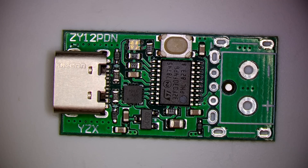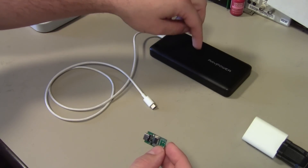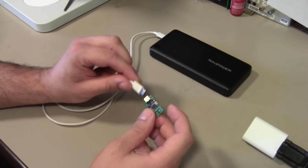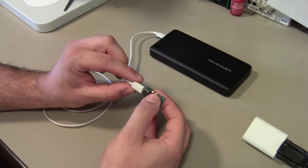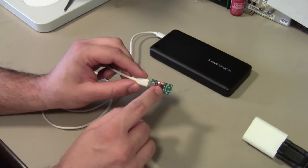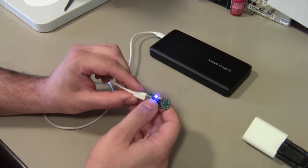So let's plug this into a USB-C battery pack and see what that looks like. For this demo, we've got a USB-C power delivery battery pack that supports all of the voltages — 5, 9, 12, 15, and 20. A standard C to C USB cable, and then one of these power delivery trigger boards. Right out of the box when you plug it in, you'll see the LED illuminate red and you'll see five volts on the terminal. As you click the button, you can see it toggle through the different colors — this microcontroller is having a conversation with your USB-C power source and negotiating the next power level. When you first plug it in it's red and you'll see 5 volts. Click it, you'll see yellow — that's 9 volts. Click it again, you'll see green — that's 12 volts. Teal is 15 volts and then blue is 20 volts.